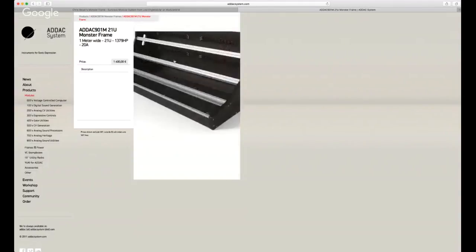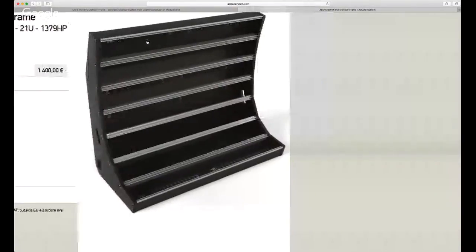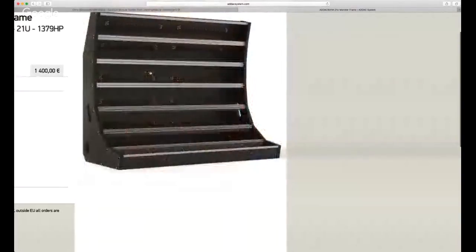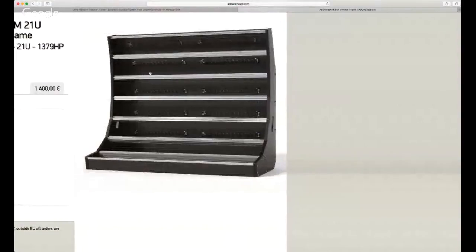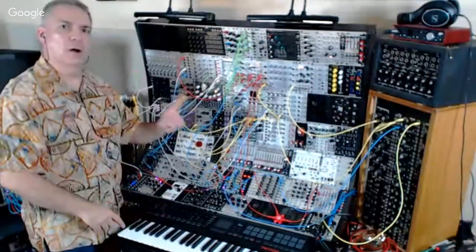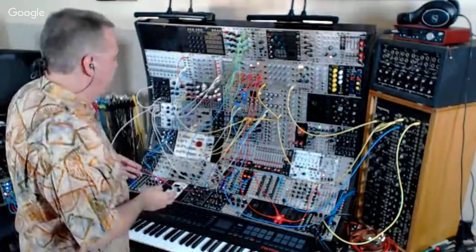No, it comes powered. He originally sold it with just 5 amps for plus 12 and minus 12, and there's no way you can fill this with modules and stay under 5 amps. So I ordered mine with 10 amps, but they forgot to install the bigger power supply when they shipped it to me. So he had to send me a brand new set of regulator boards and switcher power supplies and wiring harness for the inside of it, and one instruction was wrong. So when I powered it up, boom, the magic smoke was released.